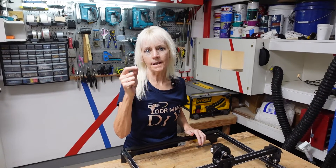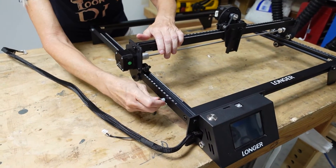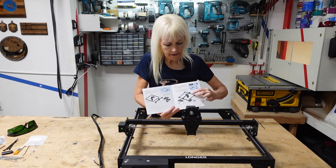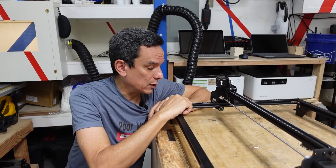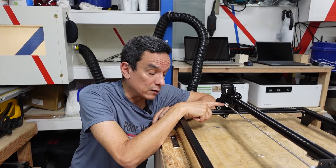The last step in number three — we're going to take the isolation cylinder and place it on the side of the frame right in here. That prevents the x-axis from sliding off. In the user guide it shows the laser module is already installed, but that doesn't happen until step five. Now we're going to put on the timing belt. The instructions show that the timing belt goes underneath the wheel, then over a device with teeth that the belt grips onto.